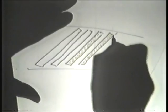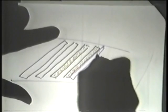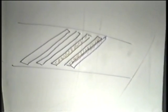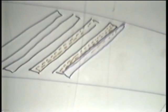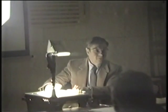I guess I should draw the other one right next to it. How about a different color? So that we have a space in here. Instead of the 2 signals butting up against each other like that, there's actually a space. Now in our normal record, we know that the magnetic material, they do touch each other, but in the SuperBeta with the narrower heads, we now have a narrower band of magnetic material put down, and the spacing is the same because the timing of the tape speed and everything is the same, so it will create a bit of a guard band between the 2.